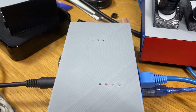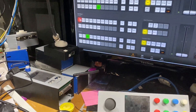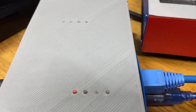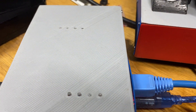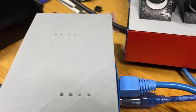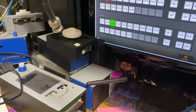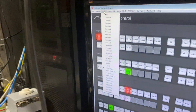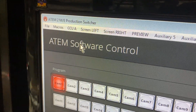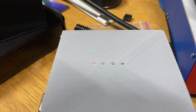Coming out of configuration, I'll use the ATEM over here and go through the inputs. You'll see tally relay one, two, three, four responding. When I click inputs five, six, seven, eight, nothing has been allocated so you don't get a tally relay even though it's doing the switching. You can actually hear the relays clicking. Now if I go up to the aux bus, you can see the four inputs I assigned.